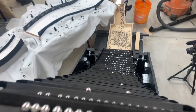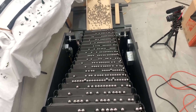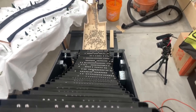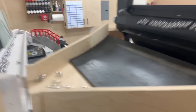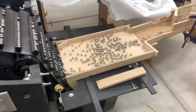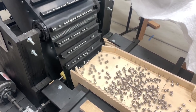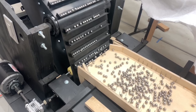Some observations about the lift: the conveyor belt has 62 rows and it takes almost exactly 20 seconds to do a full cycle — three cycles per minute, so that's 186 rows per minute. I took a sampling during this and it appears to have an average of 15 marbles per row, so every minute it's turning 2,800 marbles up the lift. That's insane. If I were to let it run for an hour, the lift would cycle 167,000 marbles — I can't even fathom that, it's nuts.